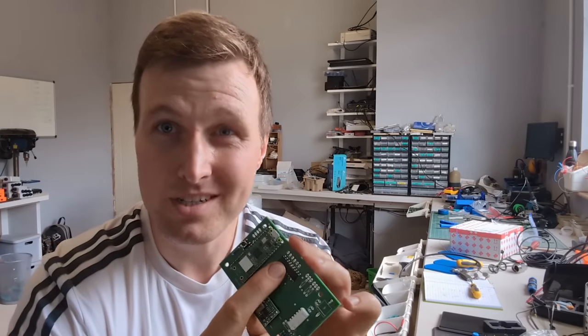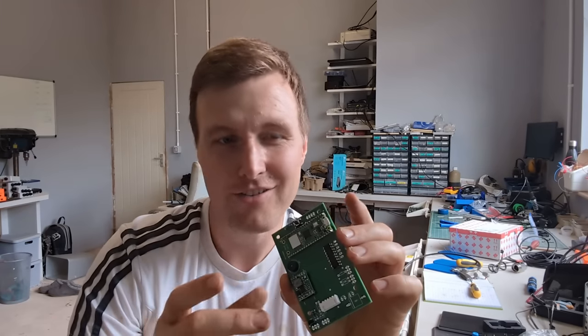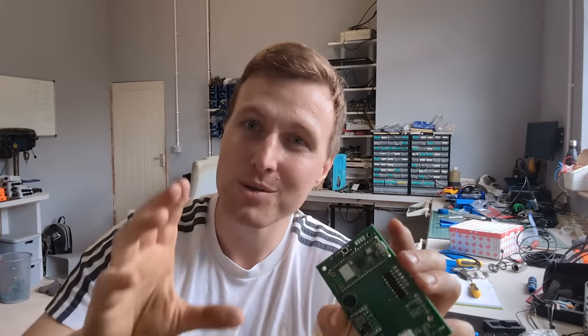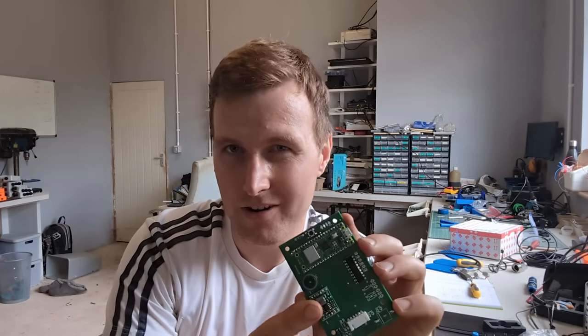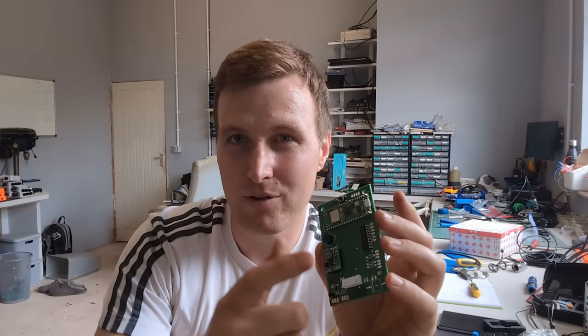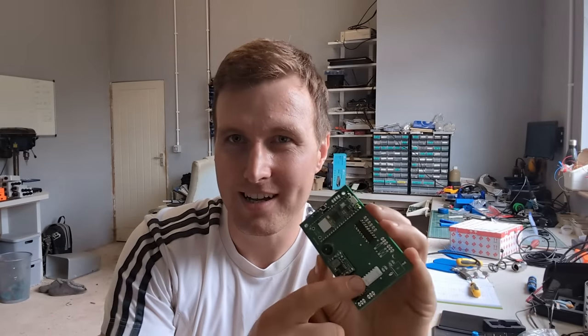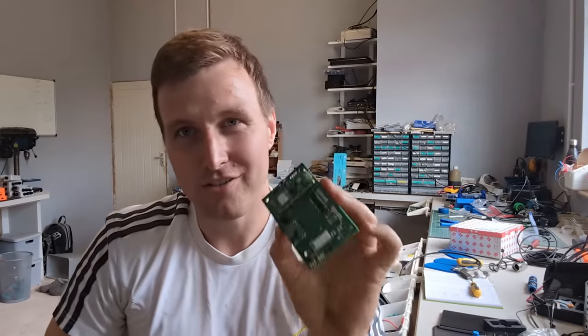We have a little chip which takes our 3-volt signals from this little processor to switch things on and off, and changes it to a 12-volt signal, which we can then use to turn on them big automotive relays in the white box, which allows us to power the high voltage relay water valves from a little tiny signal on this chip. This is a power converter or a buck converter. It takes a fairly wide range of voltages and takes it down to 5 volts, which is needed for the Pico. We have a buzzer, which isn't used, and we have a quick connector right here to break all the pins out so that if there's any problems with these boards, they're easy to switch out for a new one.